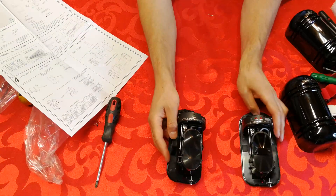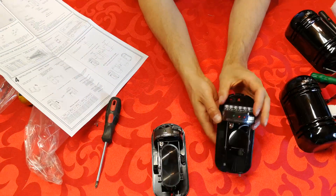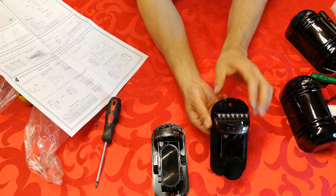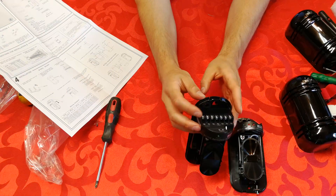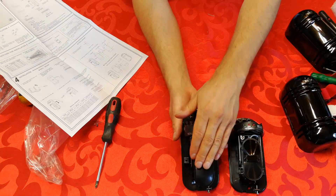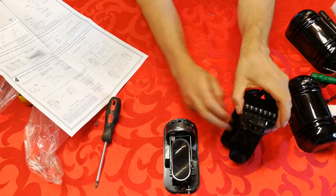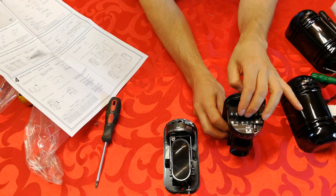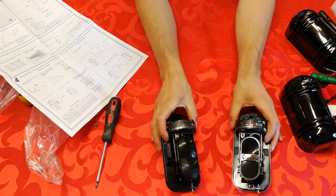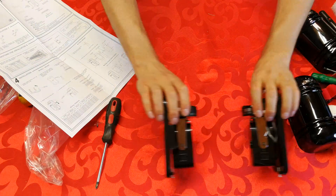When you install this, make sure you install the sender close to a power source. The receiver needs at least four cores: positive, negative, and alarm trigger. The sender only needs positive and negative. If you're short of cable cores because this is an add-on to an existing system, you can buddy off the power from another sensor, but the receiver will still require its own zone connection to the alarm system.